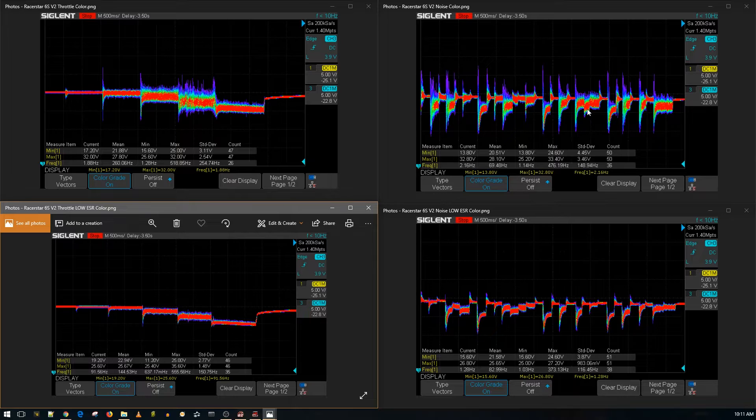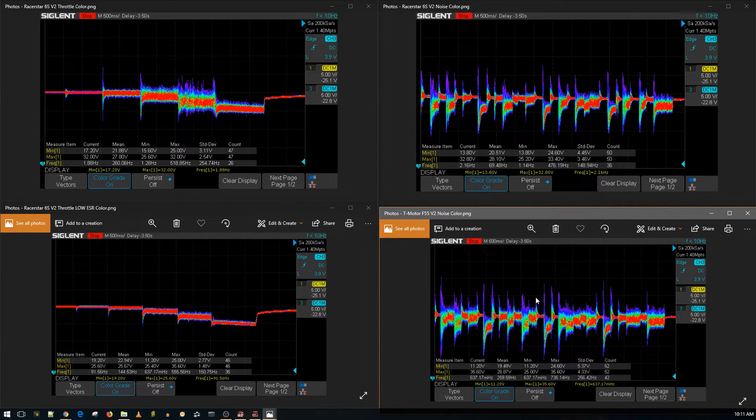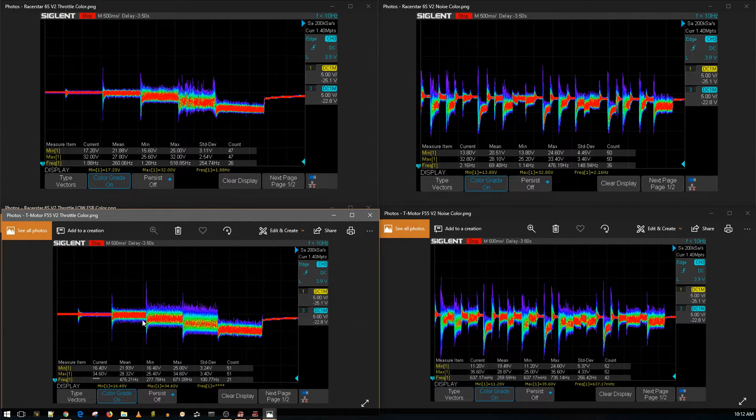This ESC is doing way better without a low ESR capacitor than everything else I've tested on 6S so far. I'm comparing it with the T-Motor and Mamba. At full throttle it's really clean. Bringing in the T-Motor's simulated aggressive flight maneuvers without a low ESR capacitor, the Racer Star is actually doing pretty well — the FETs are really good, reportedly Toshibas. The on-board filtration is suppressing voltage spikes nicely, and in the throttle noise level test the Racer Star is doing slightly better than the T-Motor.